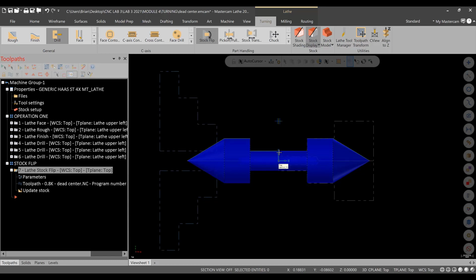Now, the 0, 0 is sort of up to you right now. It depends on where you want to set it. This area here, we're going to be machining this, doesn't really matter to the rest of the part, but if you face this, okay, manually to set your Z-face measure, you can then measure this distance with a mic and compensate that if you wanted to. You could also measure from here to here, know that distance and subtract it. Okay, you could also set your 0 on this face and push it up against the jaws. But then you gotta touch off the face of the jaws, assuming they're not beat up and things like that. So it's up to you.